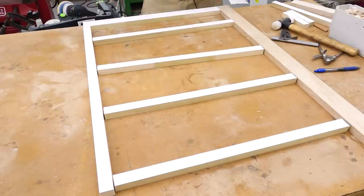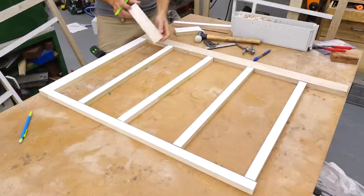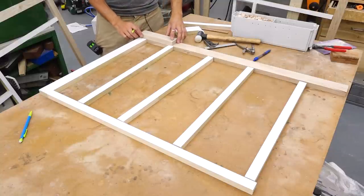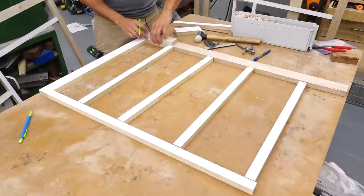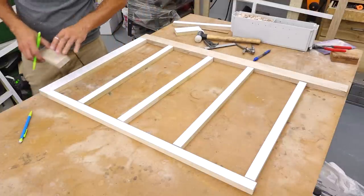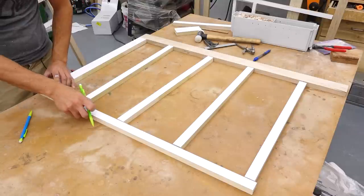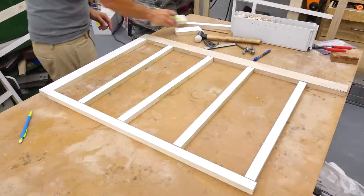And like I said, laying off my dominoes, and one of the things that I was doing as I was working is I made, you know, little template jig things like this. So this is the location of the center point of that top, I guess, rail or second rail to frame out that first drawer opening. That is technically the same thing on every single one of these face frames. They all have a 5-inch top drawer. So I can use this little block to just quickly set that center line for all these pieces.